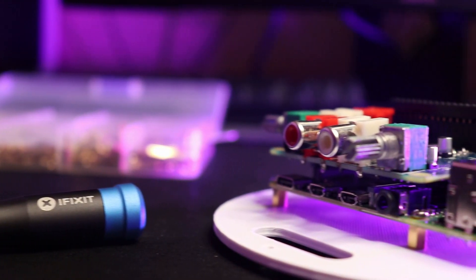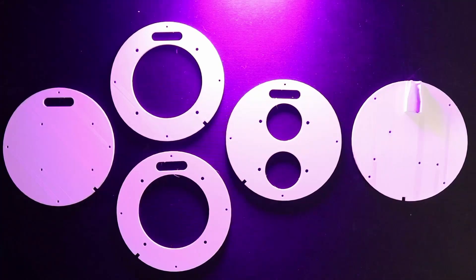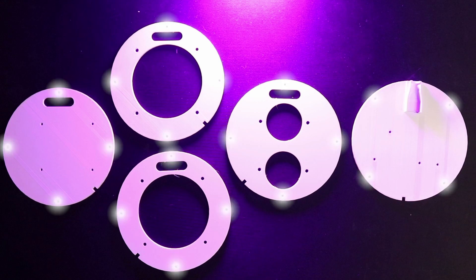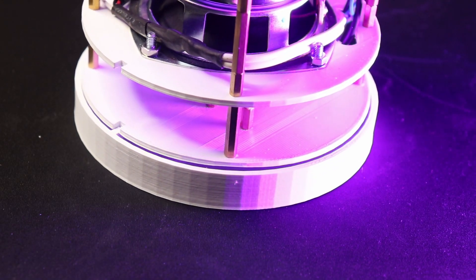The first base consists of the Raspberry Pi, which is the brain controlling everything, and the audio card that sits on top. Something you will notice is that these bases have three things in common. The first are these four holes around the plate. The second is this larger hole. And the final thing is this notch over here. The four holes around the plate are M2.5 diameter holes, meant to fit a screw that is 2.5mm in diameter. This allows us to use an M2.5 standoff kit. The larger hole is used to route wires from one layer to the next. And this notch on every layer ensures the internal structure can only go into the container one way, so that the power input lines up with the outside hole.